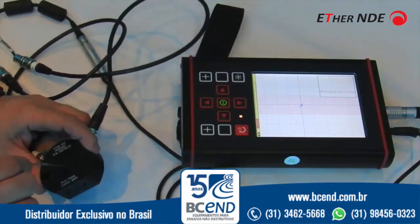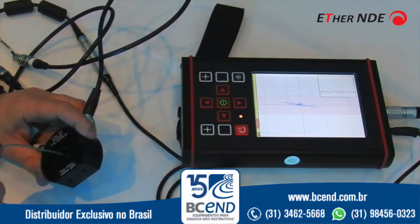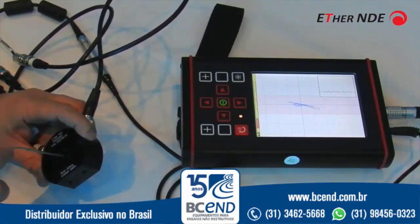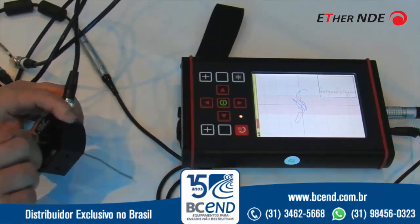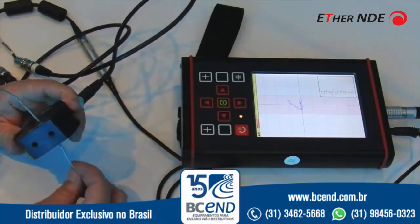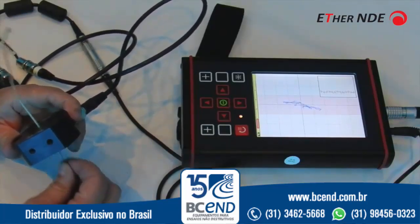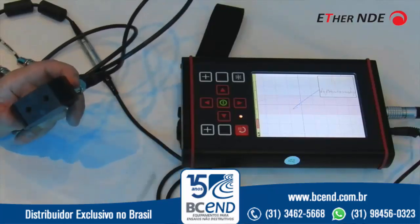That's the end of the wire going in, so we go through the wire. I've set the noise that comes from the surface — which is caused by the braiding itself — horizontally, and then we get a defect, and that gives a kick on the display. Then keep going up, there's another one up here. The main part of the braid is set horizontally so it doesn't trigger the alarm, whereas the other two do.